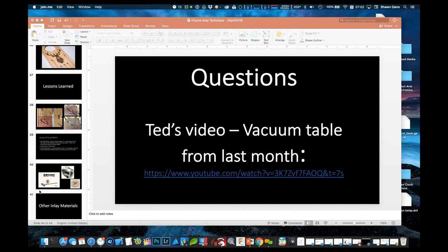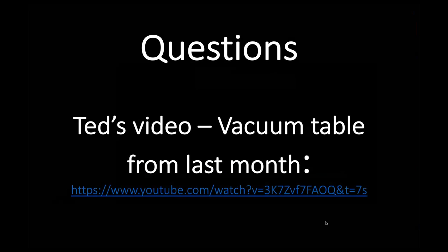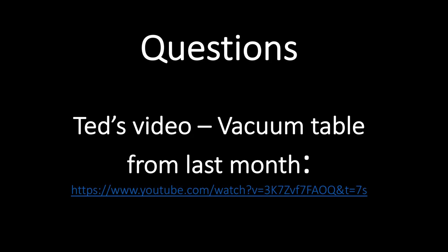Well, I'll tell you what I normally do: I try to put the sanding sealer on before I paint anything. That stops the paints from bleeding into the wood. So I try to coat everything with a sanding sealer, and from that point I put the different sealers over the top, whether it be varnish or spray lacquer or whatever you want to use. Oh, okay. So you put the sanding sealer on first, then you put colored paints on, blue, green, black, whatever. Yep. You can either use the can or the spray. Once you've got the sealer on, that stops your different colors from bleeding into the wood. Bill Chapman is really good with finishes. He might have something more to say about it than me.